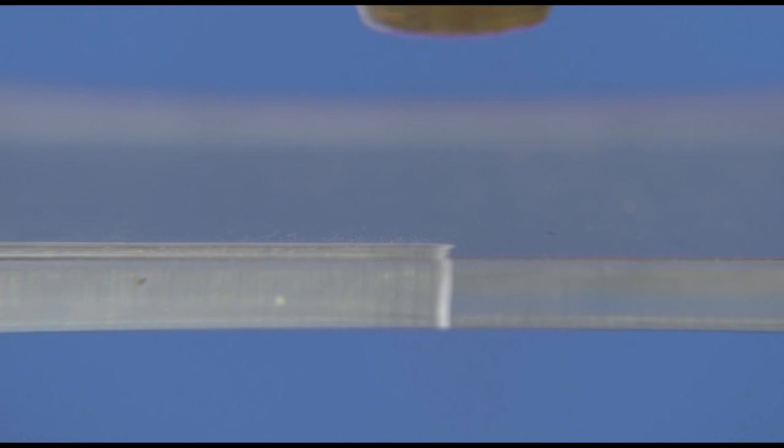Well, after all the theory, we're going to have to go and venture into the real world. I need to describe what you're looking at here because it's not immediately obvious. The bar across the page is in fact the edge of a piece of 2 millimeter acrylic. The piece of acrylic is about 2 inches wide, and you can see in the hazy, fuzzy background the back edge of the piece of material. This front edge here is in focus, and just above you can see the nozzle. And the nozzle is actually cutting a groove just inside the front edge of the piece of acrylic so that I can see approximately what's going on.